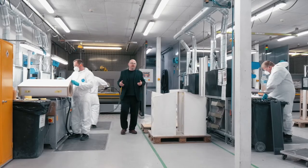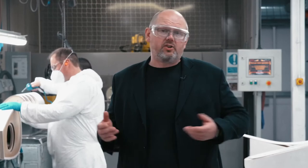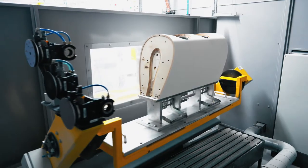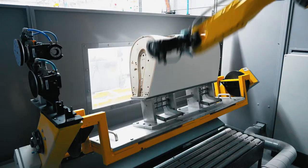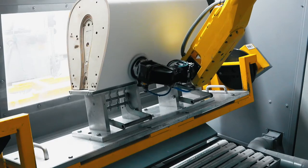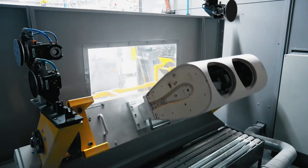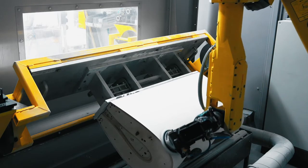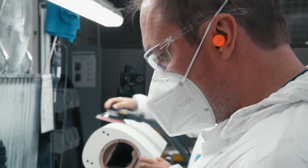The next step is to bring the cabinet to the sanding area to make sure we get everything we need for a perfect finish. There are two parts to this process. First we use a very sophisticated robot sander that works on two things: the pre-programmed coordinates for a specific model — for example an 804 versus an 802D4 have different shapes — and a force feedback sensor that makes sure it touches the surface area of the cabinet and never over-presses at any given point, constantly monitoring feedback as it runs its sanding disc over the surface. After the robot sander, it always goes through a human process for final checking — skilled operators go through all the work the robot has just done, make sure it's 100%, and finish any final areas and details by hand.